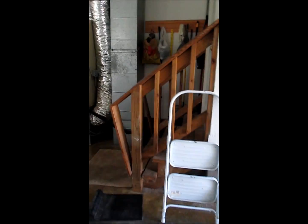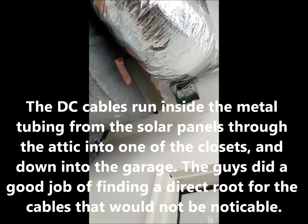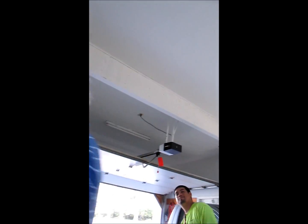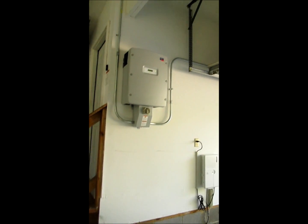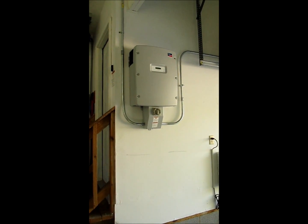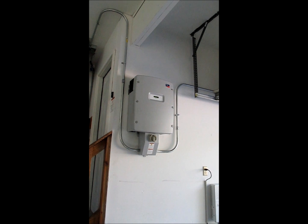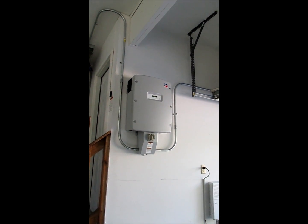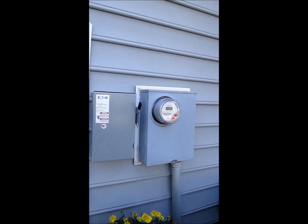You can see the wires coming in through there — that's coming from the roof. The combiner box on the roof comes down here through pull boxes, then straight into the inverter. From the inverter it goes outside to the disconnect, the disconnect comes back to the breaker panel. Nothing is showing in the attic — you can go up there and there won't be any mess. The guys went inside the duct, so you can't even see that stuff.